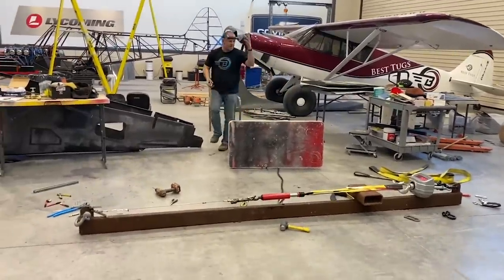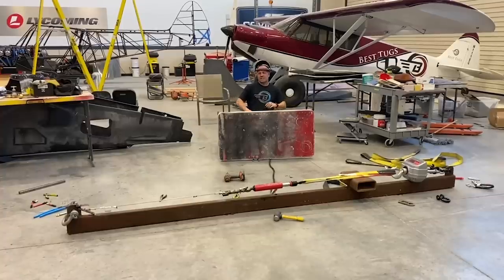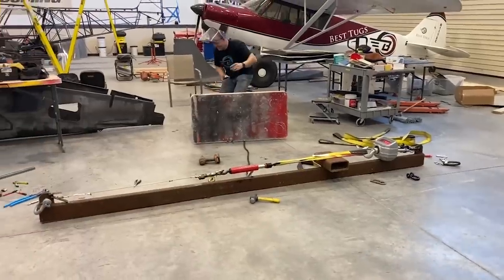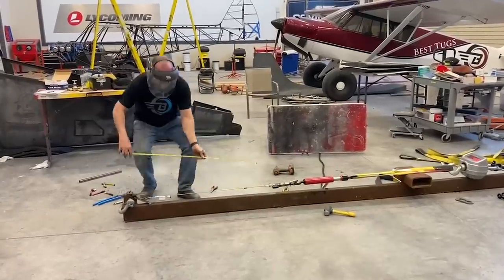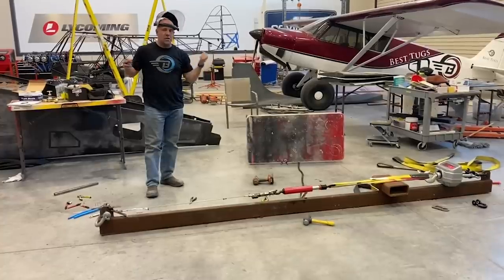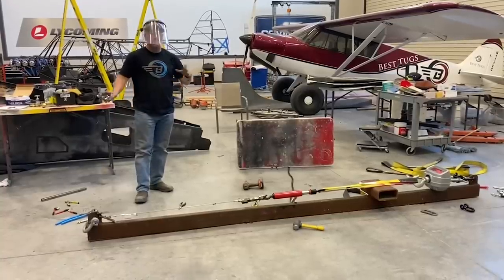Okay, there's 800 pounds, 826. Continuing to stretch. 3/16 plus. All right, 1,600 pounds. That's awesome. Oh yeah, that is a huge jump. We're a full 37 and a half inches, so this is really pulled. There's no way this cable is going back. 1,500 pounds, we're done. This part is shot.